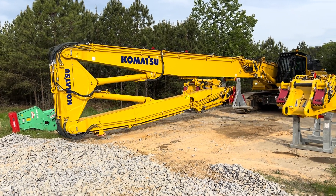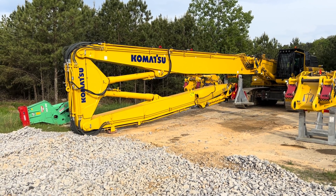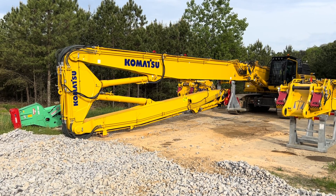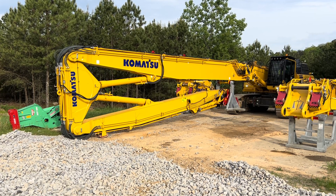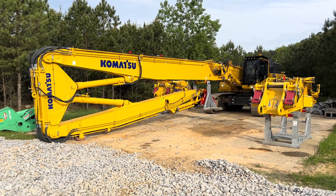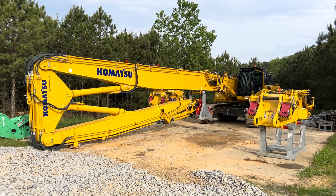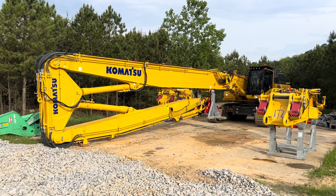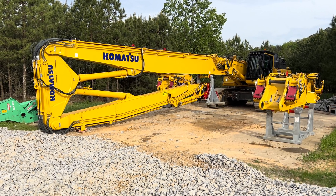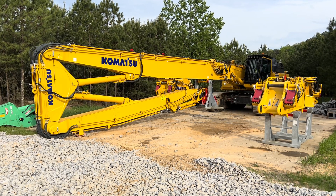He detached the tool from the work equipment and used the coupler to pick up that boom stand — the metal piece that comes with the boom and everything when you purchase an excavator. Once he connects it all together and lowers the work equipment, he goes into a separate monitor from the cab and right in that monitor he can hit unlock. What it does is depressurize the lines, relieve the pressure, and all the multiple pins that lock that equipment in will retract.